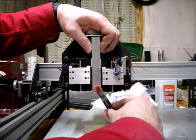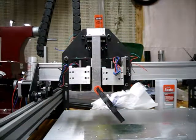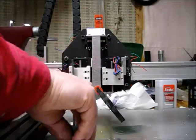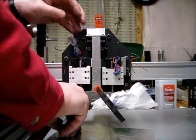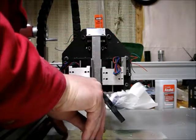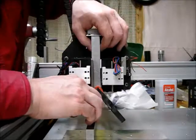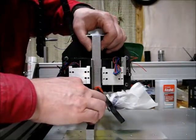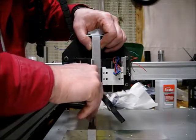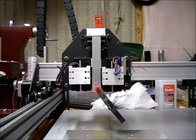That's about the best I can do there. I'm making the big assumption that the bed and the carriage are square to each other. I can check that quickly — they're actually pretty square to each other, so I don't have to worry about that. I'll pull this out until it's square going up and down, which as I thought is past the end of the plate. So I think I'm going to make it flush to this plate just because it makes all the numbers work out easy, and then I'll try and figure out why that bottom is so far off.